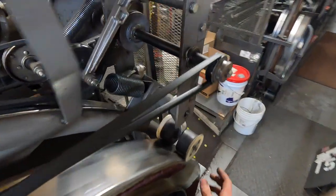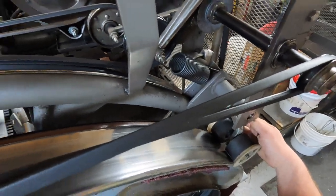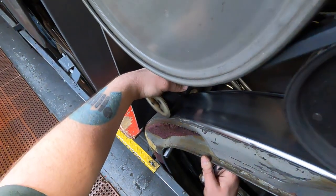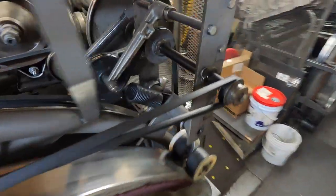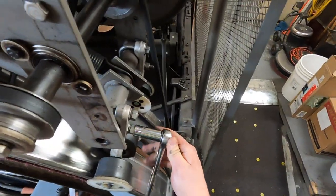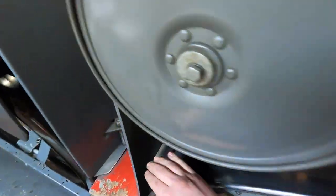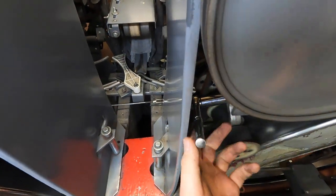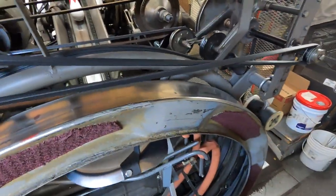The way that I was told for the pinwheel is you want to get it to where the rollers are just touching the wheel. You don't want to put it to where they're super tight, because I heard that putting it super tight is going to cause the pinwheel to bind. You still want there to be some play in the pinwheel.